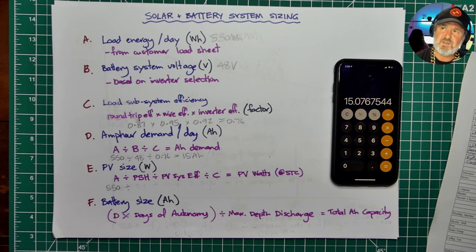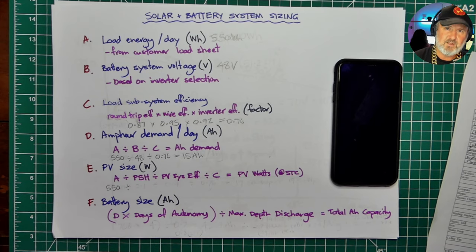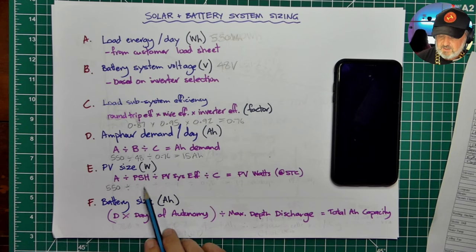NASA has a service, but it's only for equator-facing panels. But then again, if you happen to be facing the equator, i.e. in the southern hemisphere, the panels face towards the north, it will give you some data. The Bureau of Meteorology here in Australia and NIWA in New Zealand also publish quite a lot of solar radiation data, but the Bureau of Meteorology only publishes horizontal radiation data. That means if your panels are perfectly flat, once you tilt them, they'll generally work better, certainly if you're in a more southern latitude. So this might be the hardest one to find.